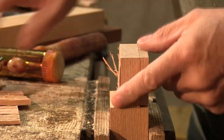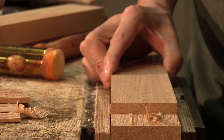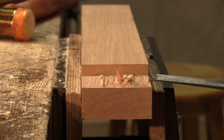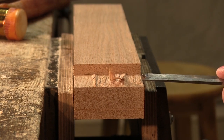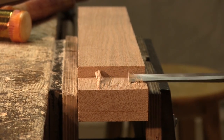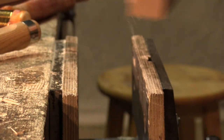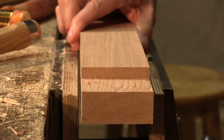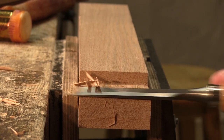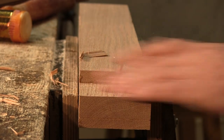There we go — I can go directly in, split, split, and take that off completely. I could continue splitting or go into the vice using the double-handed method, straight onto the gauge line on this side, then with the heel of my hand just pop it. I've got a nice flat start, then two-handed I pare away at the face of the tenon.